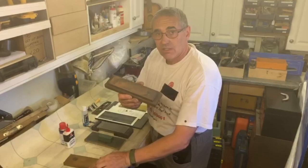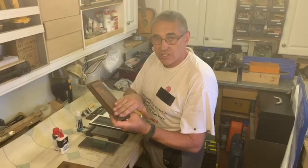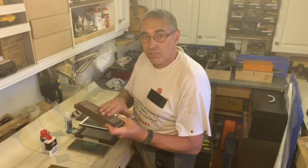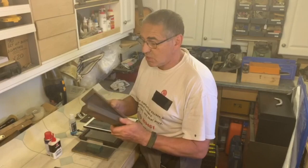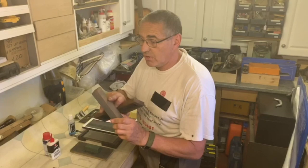Starting with oil stones, these can be picked up fairly reasonably — fairly cheap. The only thing I would say is if you're going to buy an oil stone second hand, check that the whole surface is flat. If it's not flat you're not going to get a good sharpening; you're going to wind up putting a curvature in your blade, which is not a good thing. So realistically, either buy a new oil stone — they're quite cheap, not expensive — buy a nice little box to keep it in, again very cheap. You'd have a good double-sided oil stone that gives you a coarse side and a soft fine side to sharpen on, just for honing up and putting the edge back on.